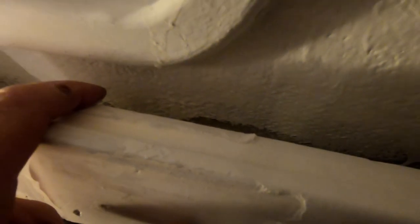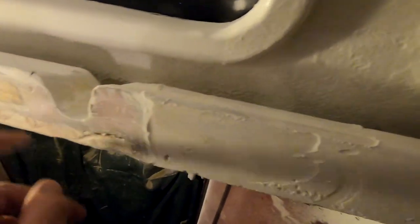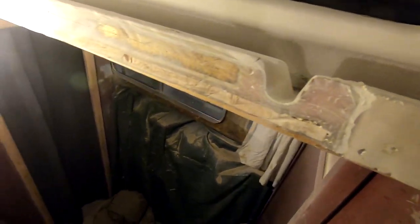So I need to fill in down here with the insulating foam that's set under the boat and now crushed to bits, but I'm going to cut that up, get that in there, fill all these voids, thicken epoxy, spread across there, get this built up nice, and get this area looking, it's looking better already. I know it's absolutely covered in rubbish everywhere, but it is looking better.